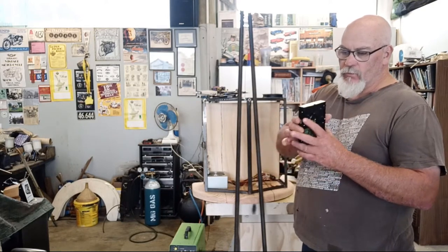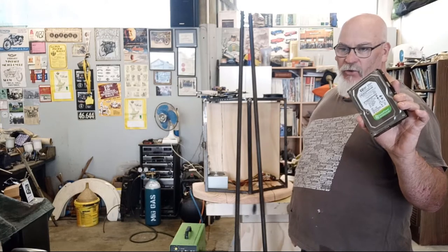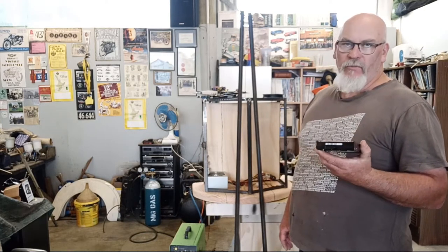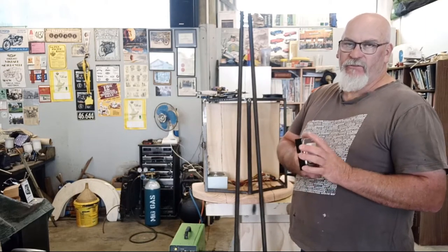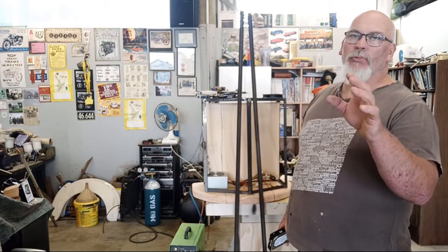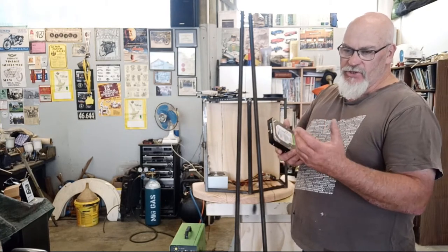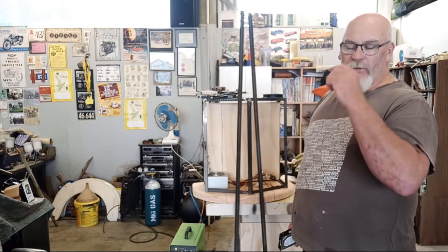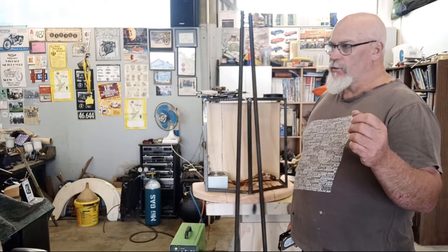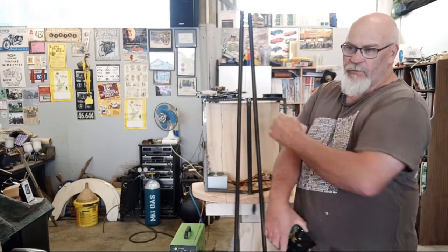Apart from that, coming back to these, just trying to educate some of you a little bit. One of these old spinning mechanical hard drives is probably a maximum of 150 megabytes per second transfer speed. A modern SSD in a 2.5-inch form factor is about 500 megabytes per second, give or take. But these modern M.2s, if you get the right specifications, you can get them in the same sort of specifications as a normal solid state, but high speed ones, and they've actually just released faster ones again. Instead of 500 megabytes per second, they're like 2,000, 3,000, 4,000 megabytes per second. And some are even faster than that now because of new generation stuff.